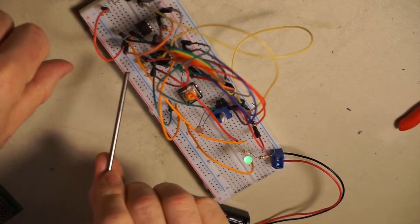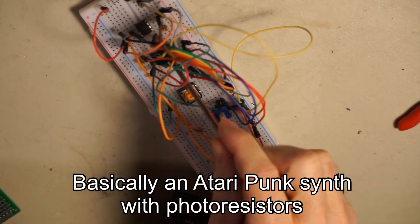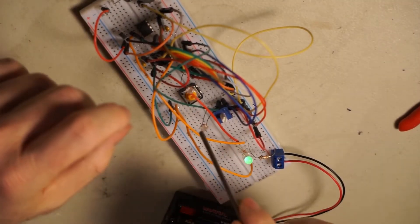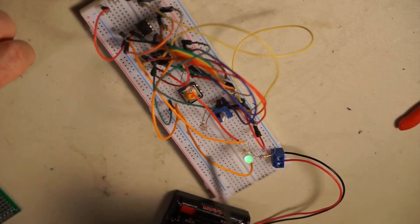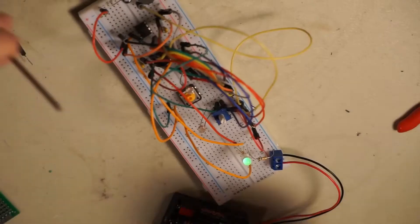So I have a circuit here that uses two 555 timers as a kind of crude square wave synth, and there are two photoresistors hooked up to it to adjust the frequencies that each of these runs at. I'll try to post a really shitty schematic here so that you can see in more detail.